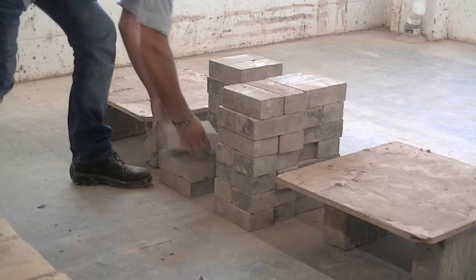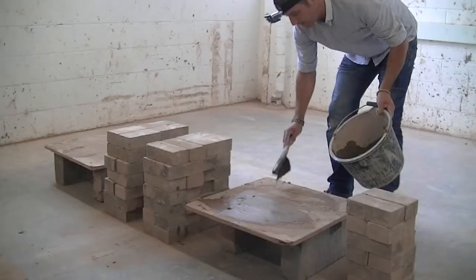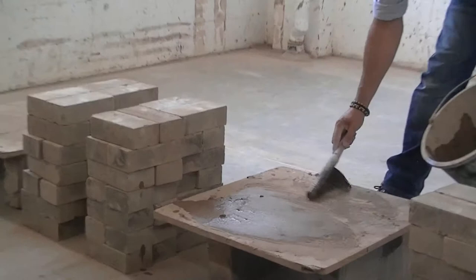And there we go — that's a general set out for your area. The next thing I would do is dampen your spot boards. The reason you do this is because if you put your mortar direct on to the spot board, it'll soak up water and tends to dry out quickly. So just with a brush and a little bucket of water, if you just damp the board, it'll stop your mortar drying out as quick.